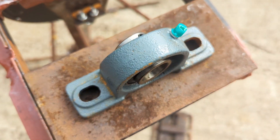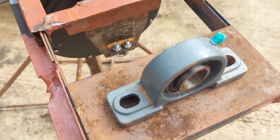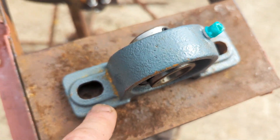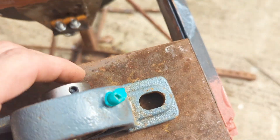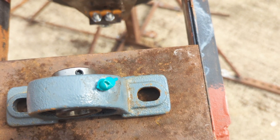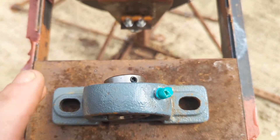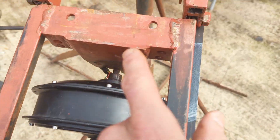The second job is to make the all-important plates where the bearings can fit. That's fairly simple — two holes with an elongated slot type hole, which is a bit of a pain. Even if you drill the holes perfectly centred, there's still some movement from the bolts. The plan is to drill the holes as closely as possible, then the rear bearing will go here and another plate will go there.